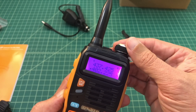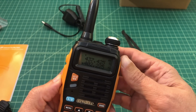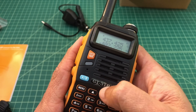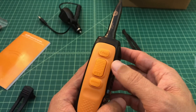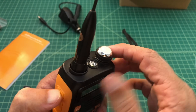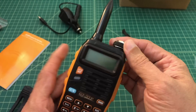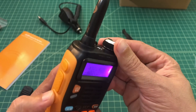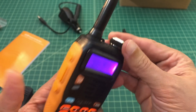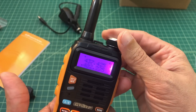Powering up the radio, we can see that it comes shipped with some default frequencies. We're going to remove these because I don't believe they're appropriate for the American amateur band plan. It's also a good idea to make sure the battery is fully charged before use. The radio has all the accessories you'd expect from Baofeng: on the left side you have a call button, a PTT button, and a monitor button. The power and volume knob has a silver coating which might get scratched with use. When the radio is on, the monitor button can turn the flashlight on. It has a VFO/memory mode button, an A/B button to switch between channels, a band button to switch from UHF to VHF, and a menu button.